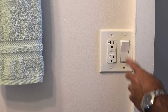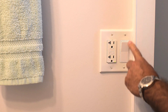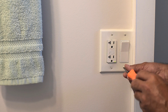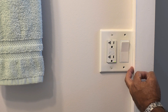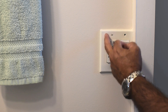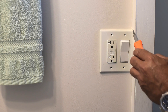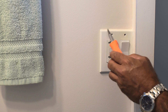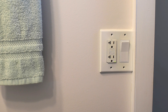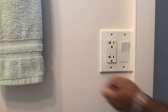I'm going to be turning off the electric to this three-way switch in just a minute. But first, let me take these screws off and take a look inside to show you what we're going to be working with. You can see the cover is right into the wood, so I'm going to have to fill in that wood and repair the plaster when I move the switch. Over here, the cover is not going to come off so easily because I sealed around the perimeter using caulking, so I'm going to take a utility knife, cut that clean, and then pop the cover off.